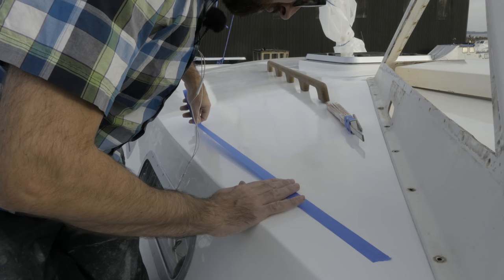If you want to do this logo thing on your boat, definitely go with a plastic stencil in one big piece because removing each of these little pieces of masking tape is the devil. And done! I'm going to call this a 7 on the spiffiness scale. There is definitely a little bit of a learning curve with KiwiGrip. The reason I'm not completely satisfied is because the texture varies quite a bit — in here there's hardly any texture while out here it's pretty aggressive. But this was the first large section I did; on the last section the texture is a lot more uniform. If you're going to apply KiwiGrip, I would highly suggest you practice a little bit. Fortunately it's not super noticeable, and one of the good things about KiwiGrip is you can give it a light sanding and apply more — so if the difference in texture drives me insane, it's an easy fix.